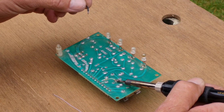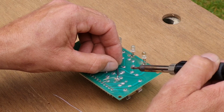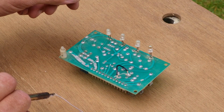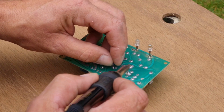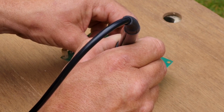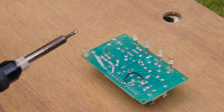So we'd better now come here. Ah, that's all gone in there now. Well, there you go. We're on. Stevie Wonder would love to see that, wouldn't he? He would indeed. Alright, where have we got to go with it? We got to come down to this one here, look. So I think I need to tin this end of this wire again. He's tinned. Now I'm trying to keep this repair as small as possible. The only thing is there's pins sticking through and you can't get no heat on the actual solder bit. We're on. Let's get a bit more solder on there, look. Look at that. Oh, that's got wires getting hot. There we go. Look at that for a repair.